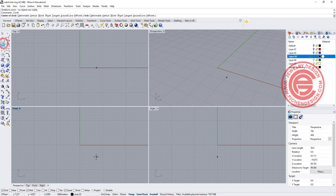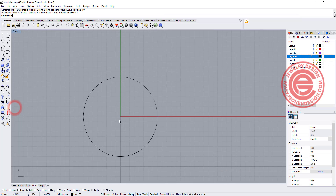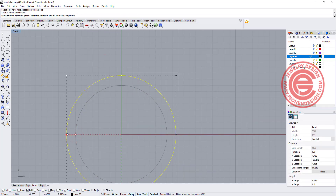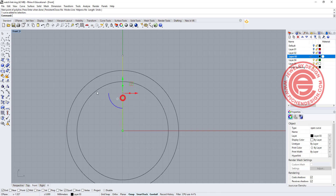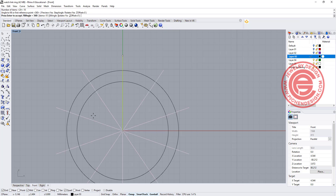Let's start with the ring first. We're going to use the circle and set the diameter to 16 millimeters, adjusting to whatever ring size you want to start with. I'm going to 3D scale it up for the thickness of the ring band, just a little bit over 1.5, and make a copy. I also want to draw a straight line and use the polar array to see how many sections we need. Let's try 10 and see how big the length is — 10 looks good.